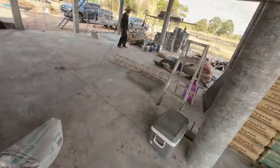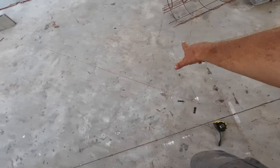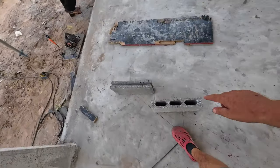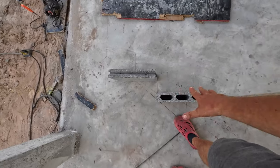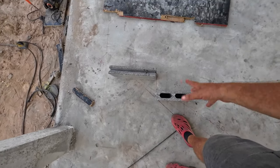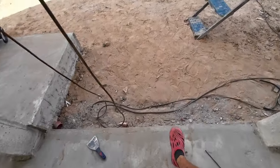So I'm working on the stairs. So I've actually drawn out a pattern here for how the stairs work. So the step is actually 18 centimetres. We're not using block, I'm just using this as a demonstration. So 18 centimetre between each step, 30 centimetre out, makes it comfortable.